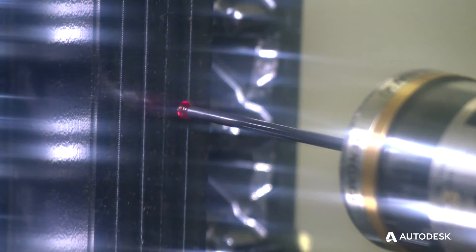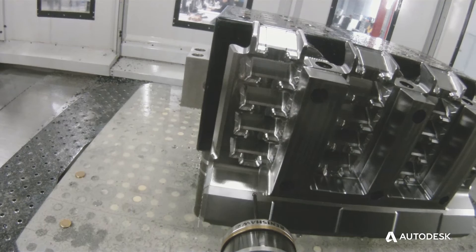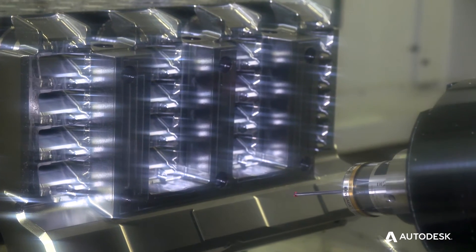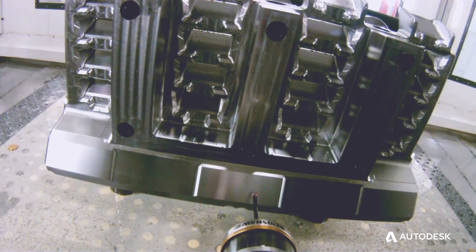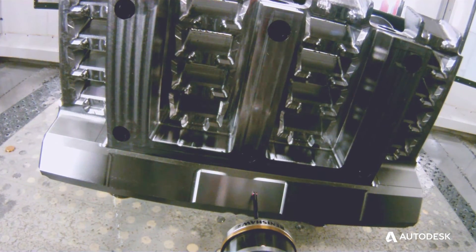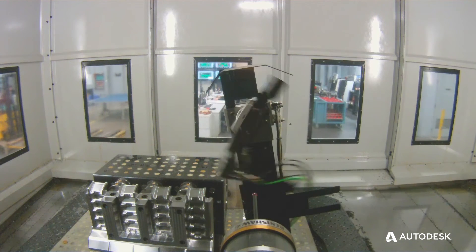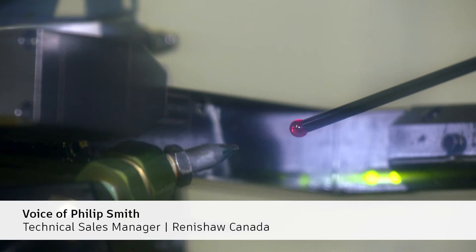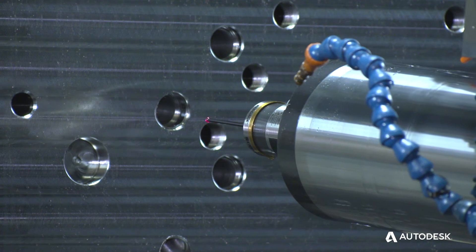You're using a very accurate, very repetitive probe instead of an operator using a telescope gauge or a micrometer. With the probe you don't need to do that — you run a probe path over it and you get your results. It really affected our rework the most and our quality coming off the machines. Your machines are regularly calibrated and laser checked, so it gives you the confidence that if the machine is good and you're using a good probing product, then you're going to be getting good metrology.